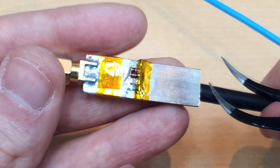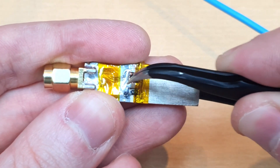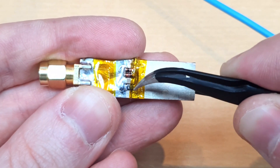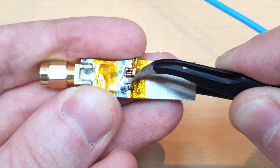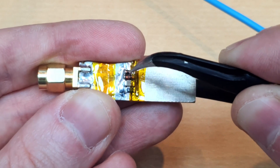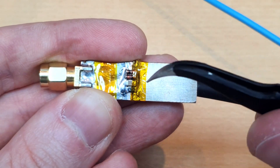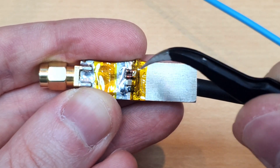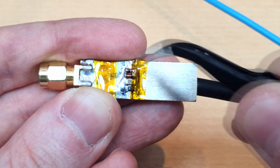But here guys, here is the main idea: you have a resistor to equalize the charge between the two grounds. So here we have a cut in the PCB and we can equalize the two grounds in the long term with this 47k resistor. We also have a capacitor to reduce the maximum voltage rise when we have an ESD discharge, and we also have two clamping diodes between the two grounds.